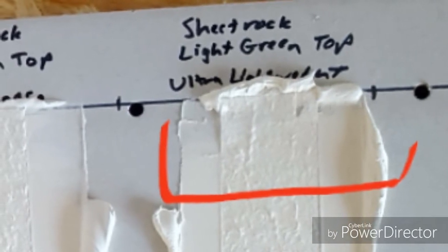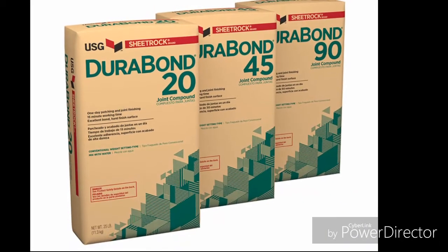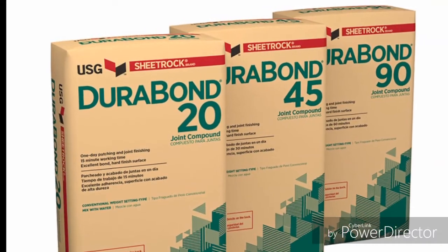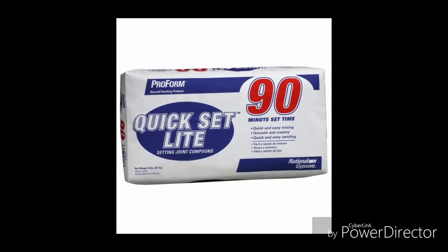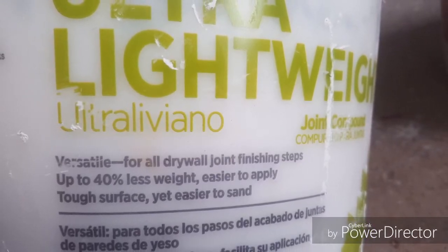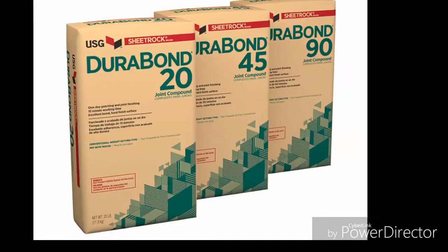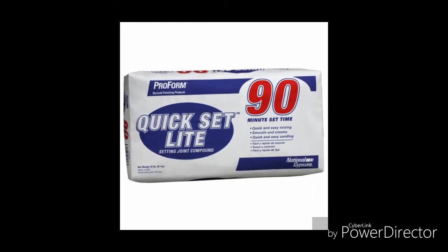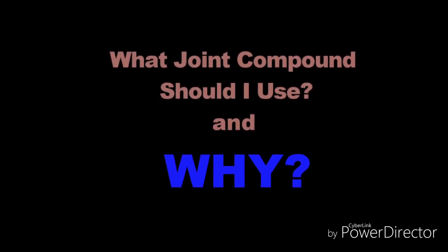Some people say you should only finish with an ultra lightweight mud, but this actually looks pretty good for taping too. So what joint compound should you use to tape with? I think they'll all work — they all stick tape to drywall — but there are clear differences in how well they stick. Based on what I can see, Durabond or one of the quick sets has the best adhesion. The ultra lightweight surprisingly did pretty well too. If I had to use a bucket compound from Lowe's, Home Depot, or Menards, I'd probably use the ultra lightweight. But since I have the option of quick set, quick set light, or Durabond — Durabond and quick set light are the easiest to find — and that's what I plan to use for taping in the future. Hopefully this helps you make your decision when it comes to taping.